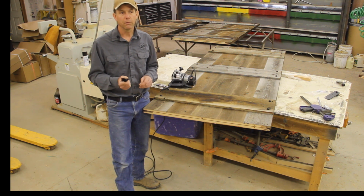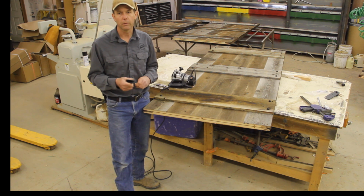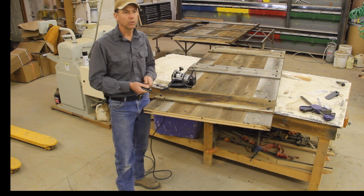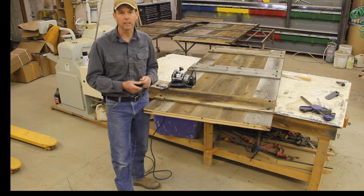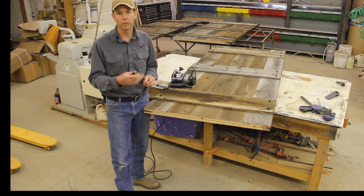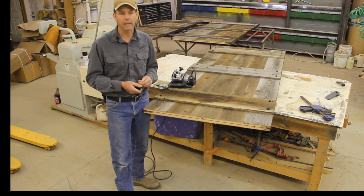We really like mounting the floor guide to the floor. It's the most secure rather than mounting it to the wall or having one of those cantilever floor guides that come out. They tend to not be as sturdy as this floor guide. If you don't want to install a floor guide at all, that's up to you. It's just not as secure and the door bangs front to back.